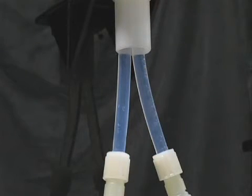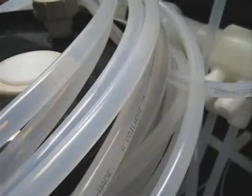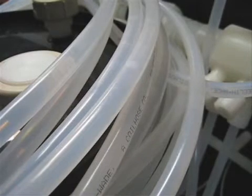In a typical installation, the flow velocity through the AquaTap is approximately one and a half feet per second, which is also approximately one and a half gallons per minute. If the tube run is extended to the maximum recommended distance of 50 feet from the IFD, flow through the AquaTap is still considerable at three quarters of a foot per second or better. At these flow rates, the pressure drop across the IFD is only about 0.7 psi — about the same pressure loss as through a fully open diaphragm valve of the same size.